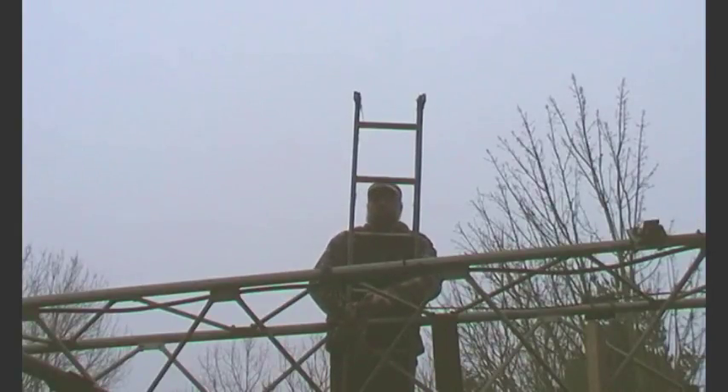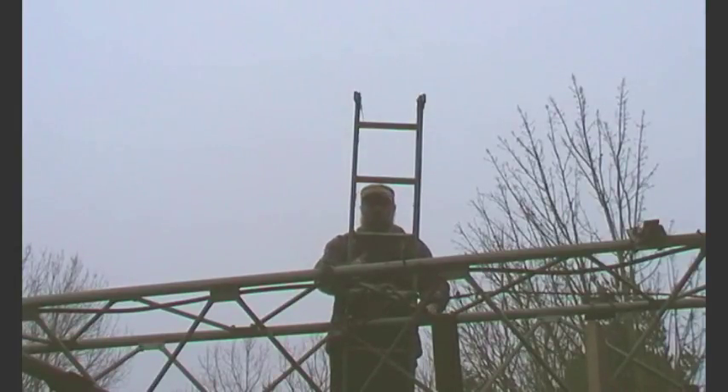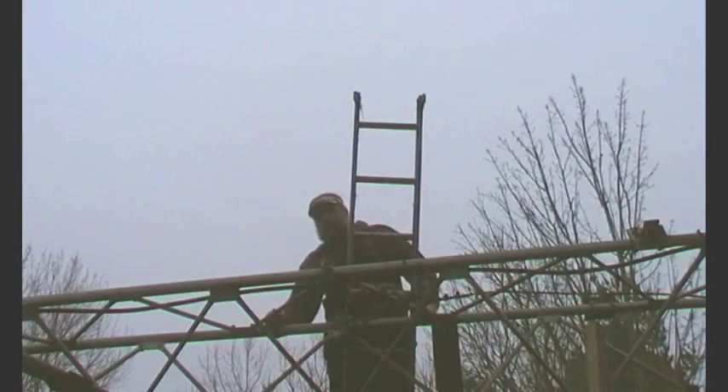With all these things on these shackles, tighten it to its tight and then half a turn back, just so that if it moves when it's been used, it just doesn't tighten up. That's moved the anchor point further up the tower, and hopefully that will improve things.